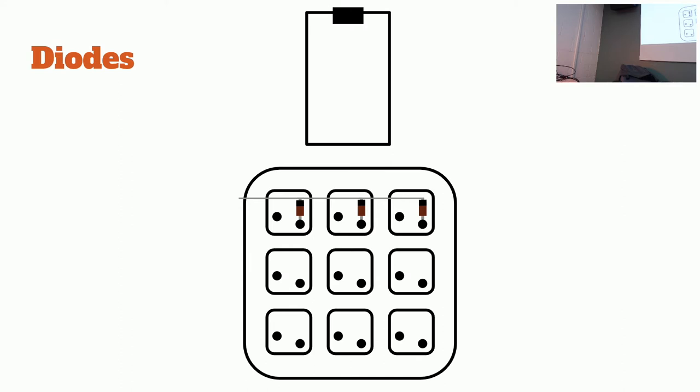So you were saying you want to heat the part that you're going to solder. Yep. And then apply. So while you're still holding the iron to it, apply the solder. Yep. Okay. I might hit that one. There you go. So add some more. So you make a pretty solid connection. Okay. I think that's pretty good.